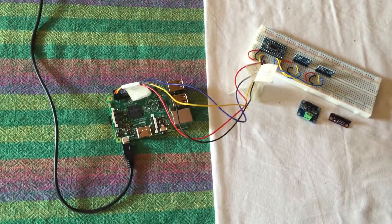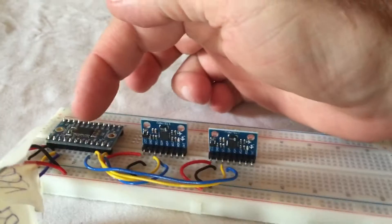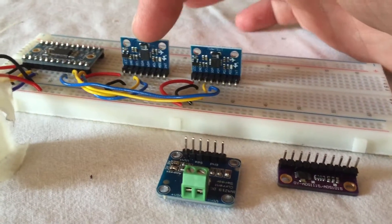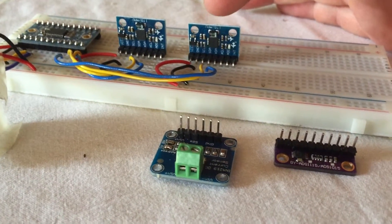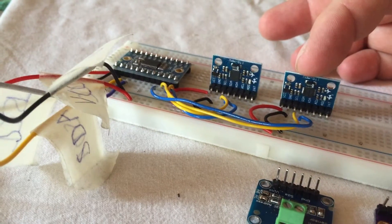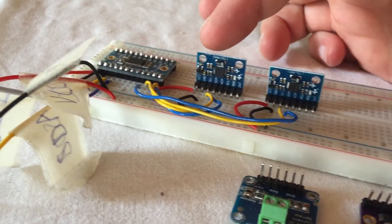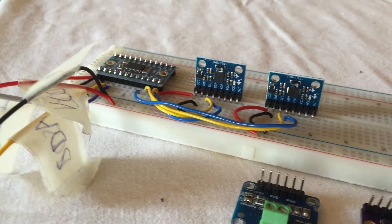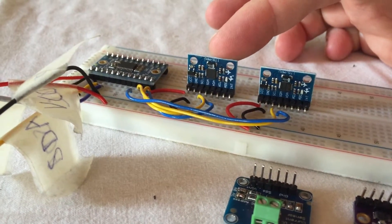In this last example I still use the Raspberry Pi and I have several different devices here. From the left I have something called an I2C multiplexer, and here is an MPU-6050 — it's an accelerometer and a gyroscope. I have connected them to the multiplexer because they both have the same address. The multiplexer lets me use different buses, so each bus can have 127 different addresses, making it possible to have up to eight different devices with the same address.